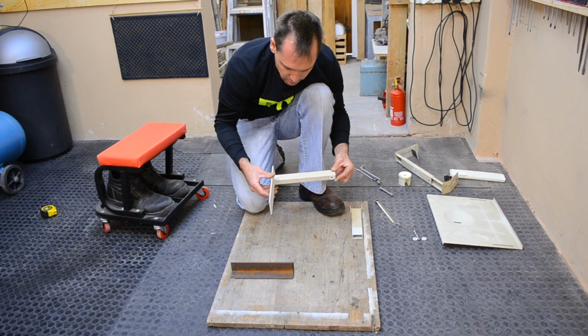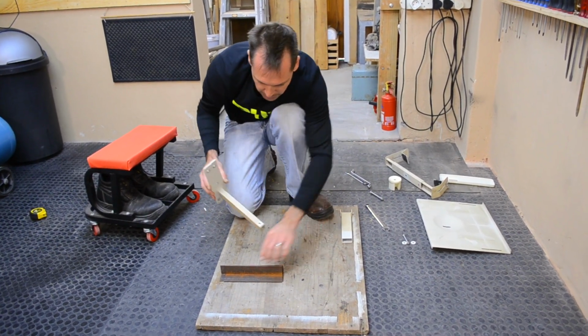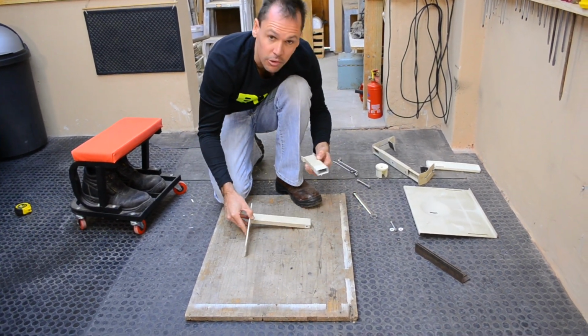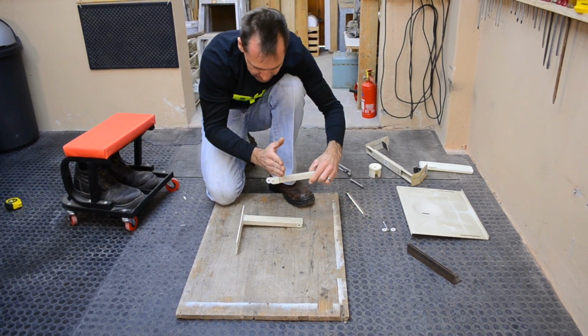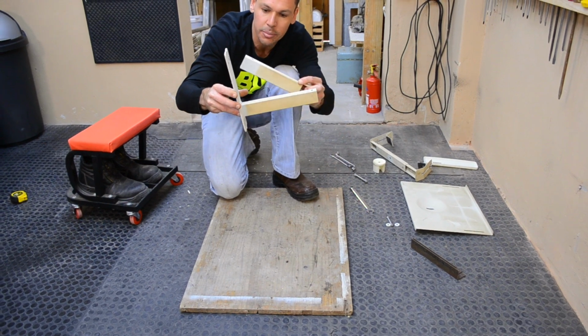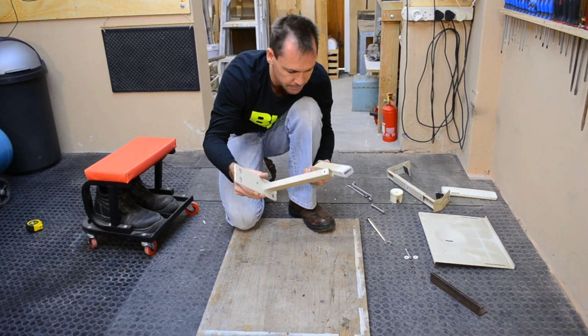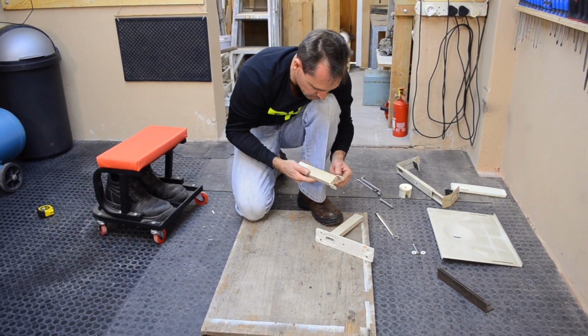After having taken this thing apart, this is where we wanted to put the gusset in. I had found these two pieces of bare steel, but I think what I'm going to do is use that little U bracket, so I'll cut that off, and then with the piece left over, I'll weld that piece in there, and that'll create our triangle. Awesome, and that's going to work nicely.